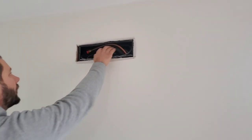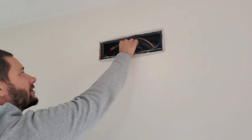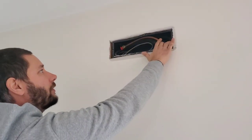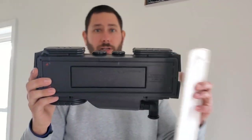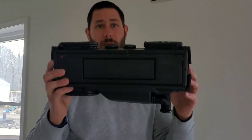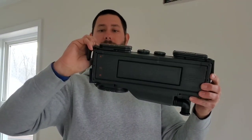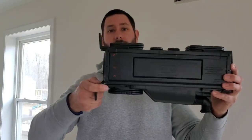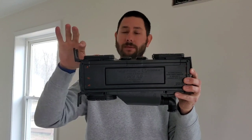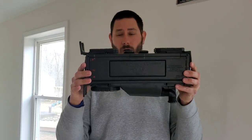You've got your copper connections. You've got your signal cable. You have your power cable, and all that is required to hook up the wall mount air handler. If you take a close look here, what's great about the rough in box is I have these brackets. I can turn these around on each side, and this is how I can securely mount to the joist in the wall.